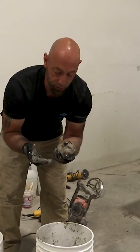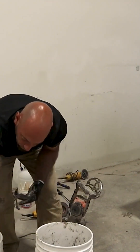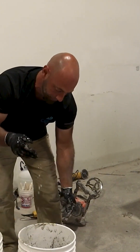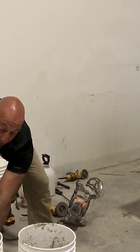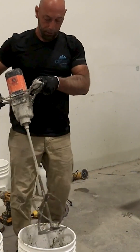When you feel like your concrete is starting to tighten up too much and you're going to lose it, don't use a pint cup to rehydrate it. Just take a little bit in your hand — that's all you need — because again, too much water means weak concrete. So just a little bit and re-whip it.